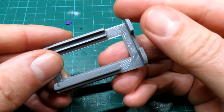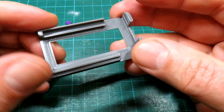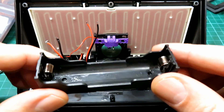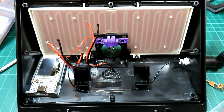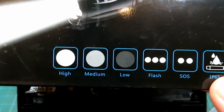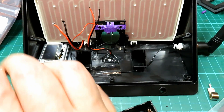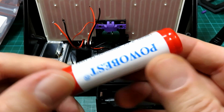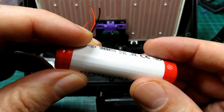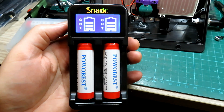I decided to fit a little mounting tray for the board, because it has pins on the underside and a battery power lead, and we'll stick that inside the enclosure. I've got some 18650 battery terminal holders. The batteries that come supplied with these lights are notoriously low capacity and 18650s can be pricey, but if you buy one of these cheap flashlights for £9.99, you get four 18650s with it. These ones claim 3000 milliampere-hours — I bet they're not — but if they're half that and I've got two in parallel, I stand a chance.